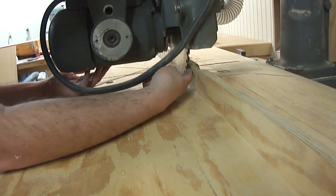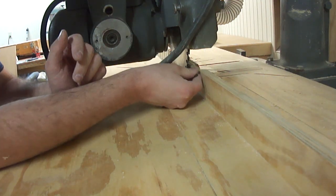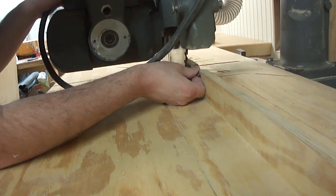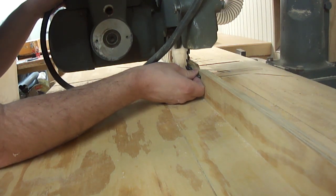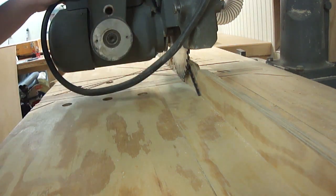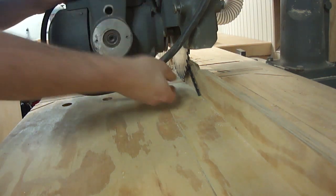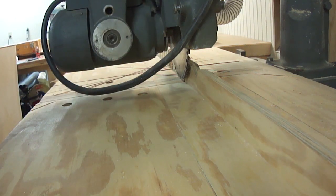The easiest way to set the groove a quarter of an inch away from the fence is to take the shank of a quarter inch drill bit and just gently set it in between the blade and the fence. Now I can go ahead and lock down the carriage lock. I know it's a quarter of an inch away from the fence. However, I still want to do a test cut first just to make sure everything's fine before I try it with the real work pieces.